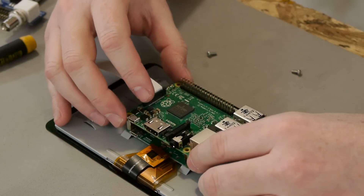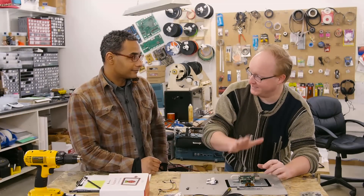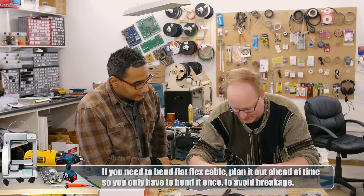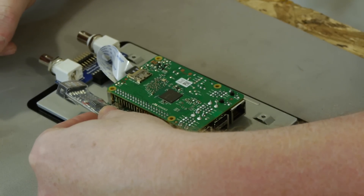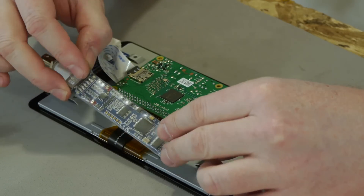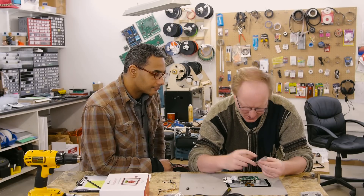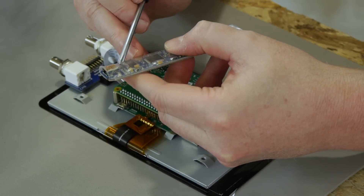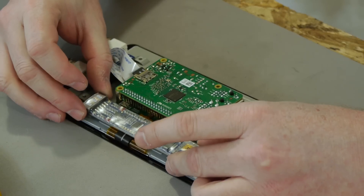Look at how much more compact that is if we can get it to work. I'm just trying to think of the best way to make it into a cool desktop unit. I think we can get away with that — it's not too horrible; it's better than doing complete right-angle bends. This part we can just rewire manually — that's only about 10 connectors. Obviously we're going to have to have screw posts. As far as the USB connector, maybe we can just flip this thing upside down and directly wire the USBs. Those are surface mount, so we can find the surface mount connectors and solder to the components there instead of the actual connector. Yeah, that's pretty compact.